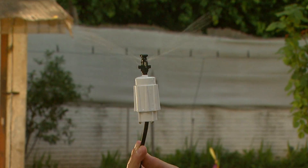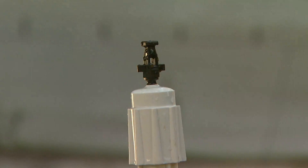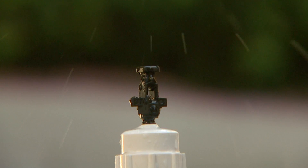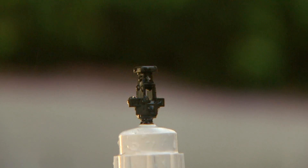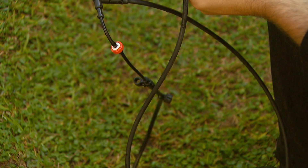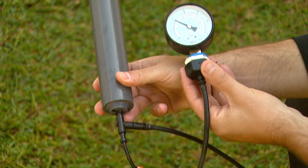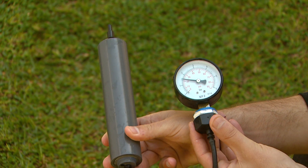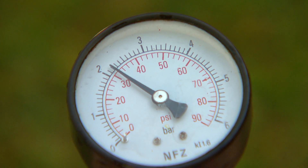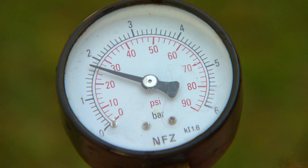The Series 200, situated upright with a specially designed PIP strip jet, is used for frost protection. It sprays a strip about eight meters long and 0.3 meters wide. The unique low flow rate allows the entire system to be operated once temperatures drop to freezing, at a flow rate less than one third of its competitors. Each pulsator is also a preset pressure-responding, normally closed valve — meaning any pressure lower than the preset pressure at the inlet results in no water flowing through the outlet.